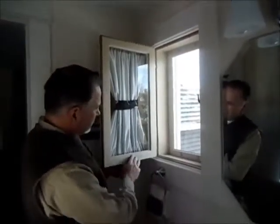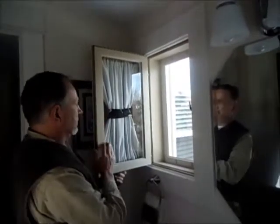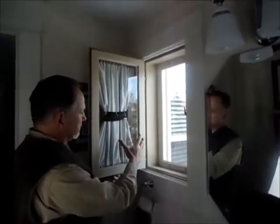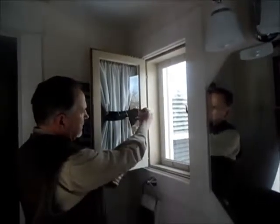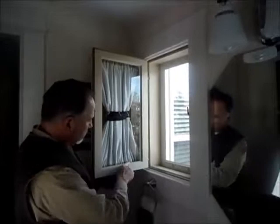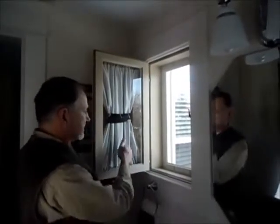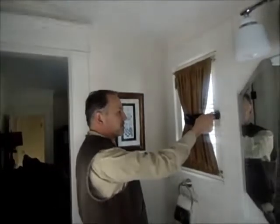This sash, when reconditioned, we stripped all the paint off of it and then made repairs to it. And then before we bedded the new glass in, that went in with silicone. And then we glazed with this commercial glazing seal called NP1. It makes a tight seal and really does a wonderful job.